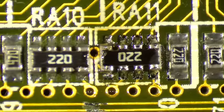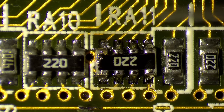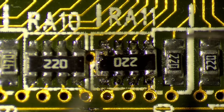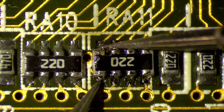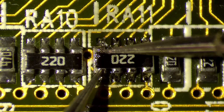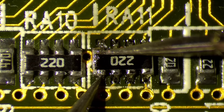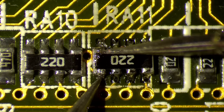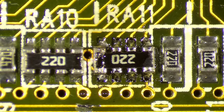This is all good but this one is not. Let me check what ohm reading I get here — nope, open line, there is no connection. That is odd; it beeped before a little bit, and now it's completely dead. I'm getting megaohm readings. This part is dead. So let's just get rid of this and replace it.